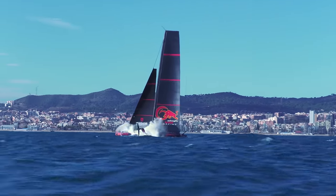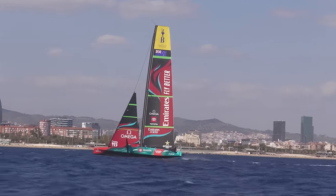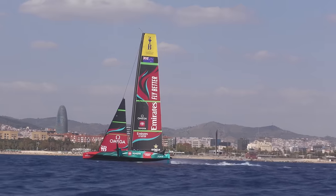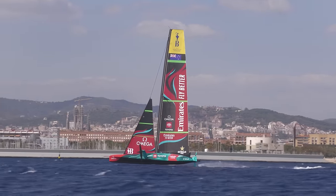The other factor is a totally different venue. In Barcelona you don't want a big flat fat hull smashing into waves, and you also don't want to be flying a big fat hull high above waves — teams have realized that trying to seal the hull down onto the water and get that end plate effect gives a good performance gain. Deep bustles make sense for waves of one and a half to two metres in Barcelona where the arms just aren't long enough to accommodate that, so you need a form that end-plates the hull but is also okay with being slammed through waves.